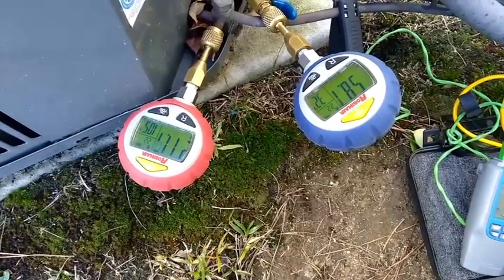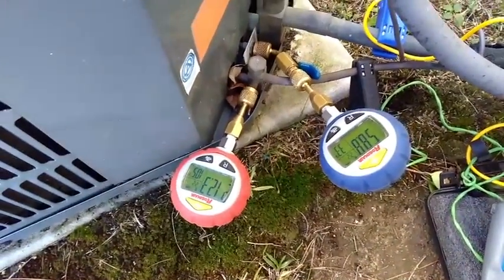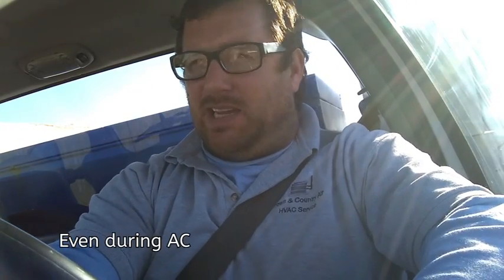We already have a lot of freezing outside. It's warming up out here — we've got 52 degrees. We'll let it roll for a little bit and if it looks okay we're going to be done with this one. So we had that thermostat situation — I removed the one downstairs, which was an old Focus Pro 3000. It was doing some crazy stuff; they said it would throw the auxiliary heat on randomly. I'm not quite sure why that stat started doing that. The display was messed up on the thermostat, so it could have been set for auxiliary heat but it didn't show up properly. I removed that thermostat because this was not a zone system.